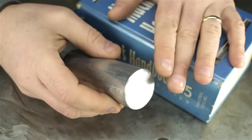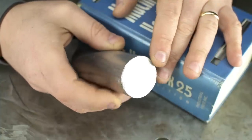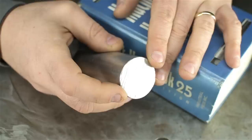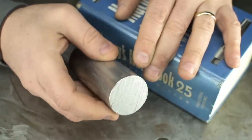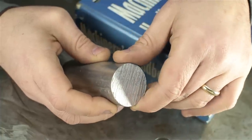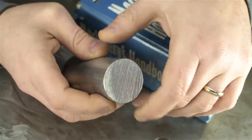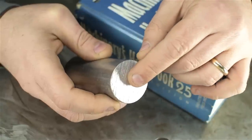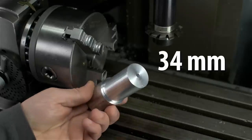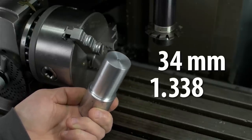Note that all these numbers are nominal — I've made no mention of tolerances, except for the number of teeth: we do need exactly 15 teeth, no plus or minus on that. If fit and tolerance are important to your application you'll need to dig deeper than just this video. This happens to be 1.5-inch stock, about 40 millimeters, so I need to turn this down to 34 before I can start gear cutting. The reason I'm making a 15-tooth module-2 gear is because I found this piece of stock in my cutoff bin — already 34 millimeters, or in more approachable terms, 1.33858 inches.